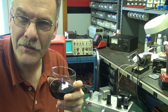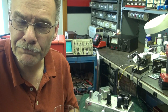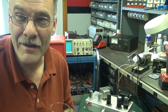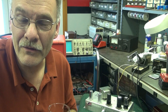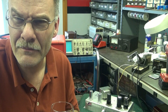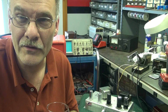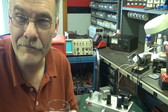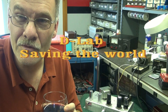Here's that glass of wine that I'm known for. Anyway, as you can see, a lot of these hum problems with amps may not be the fact that your inverter tube is miswired or your heaters are misrouted in the amp. A lot of times it can just be that the design was wrong — and in this case, that's what it proved out to be. So in the next video, I'll get the owner here and we'll have him play it and see if he's happy with it now. I hope you enjoyed the video — see you again.